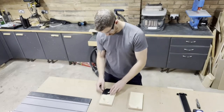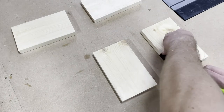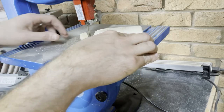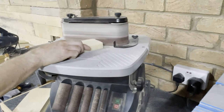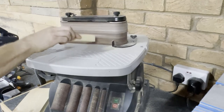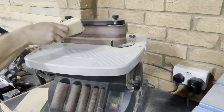Then it was straight on to rounding off the corners of the shelf elements. I've got these little round over profile pieces so just used them to draw a line that I was happy with. Then I took it to the bandsaw and cut just outside of the line on each of the curves I'd drawn. Next was the sander to finish off the curves, but the belt on my sander was really clogged up, so I've got this sandpaper eraser which is basically just a giant pencil eraser. It gets rid of all the marks and clogged up material in your sandpaper and makes it last longer. I got this one off Amazon for a few quid and as you can see it does a pretty good job.